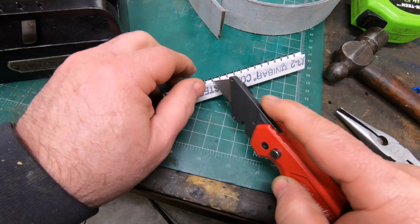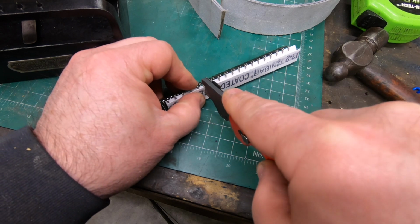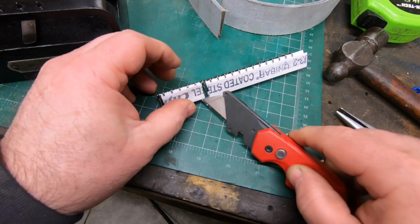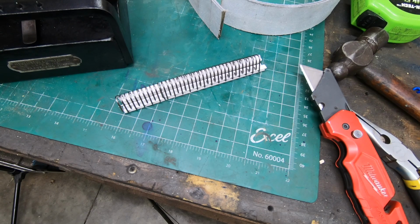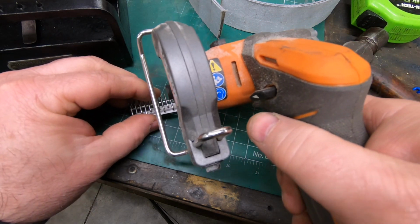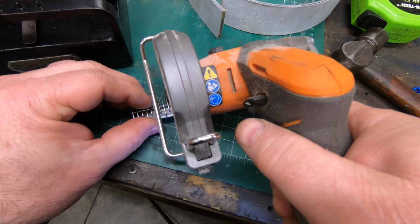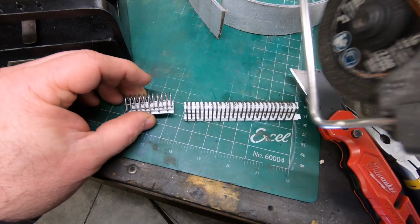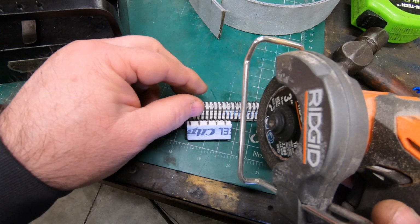Well, I bought a couple of feet of some belt material and some lacing from McMaster-Carr so we can give this a little bit of a test. Now, unfortunately, it turns out that I bought the wrong kind of hooks here. These are called a unibar lace, and they are not recommended for situations where the pulleys are crowned. And on both of the South Bend lathes, there is a crown to the pulleys.